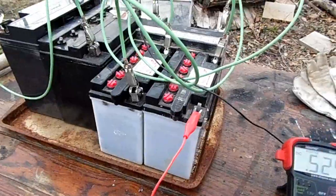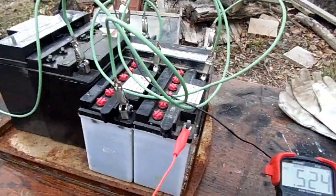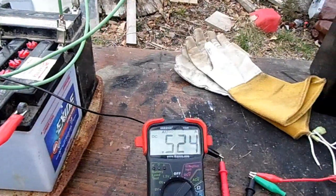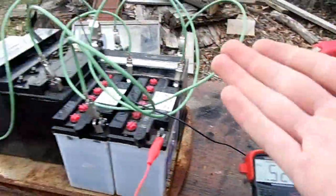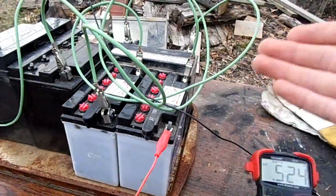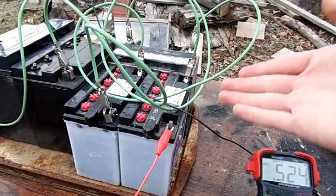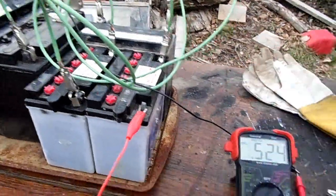With this setup right now, we're limiting the amps to only half an amp, so it'll just slowly charge the battery, which is really great. But the problem is we're not limiting the volts. So once these batteries get charged, the voltage will just keep going up, because there will be less energy going into changing the chemistry inside the batteries, and so it'll just keep going up until they start bubbling over.